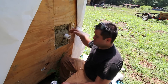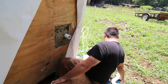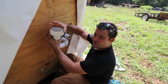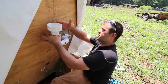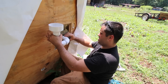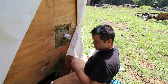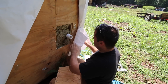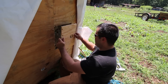So I glued that 90 up to it and then I have this pipe coming out. I did some calculations — I wanted to make sure this pipe will allow me to still have about a three and a half to four inch clearance off the wall, basically an inch and a quarter. I made sure I did my math. I went and packed insulation into the back there. So I got that circle cut out.